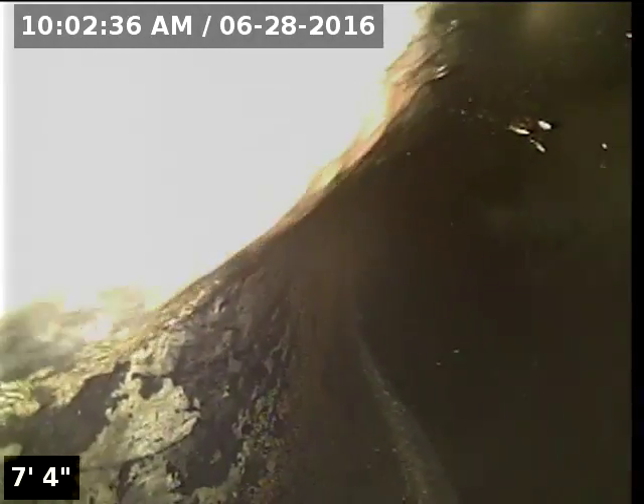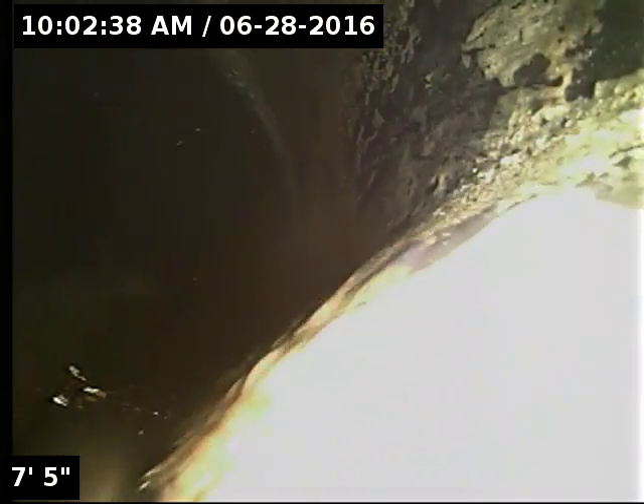Good morning, I'm Jeff. I'm with Sewer Tech NW. Today we're at 3083 NW Montara Loop here in Portland. We're located at the front of the home, just off to the left of the front door. Underneath a steel plate, we have a 4-inch ABS clean-out. There's the cap for it. I'm going to insert the camera and check the overall condition and serviceability of the sanitary sewer line.